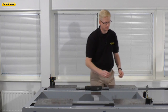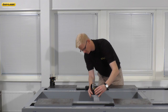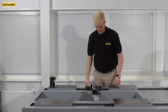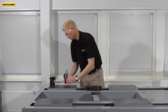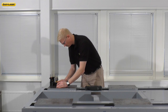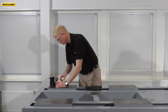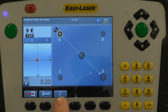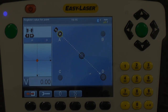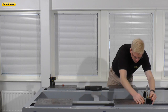As we're using the center point as a reference, we need to make sure that the laser hits the target while placed on the center point as well. Now move it back to pad A and remove the target. I'm now going to zero set the value. Once I've zero set on pad A, I move the unit back to pad D.